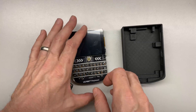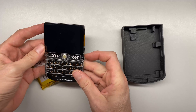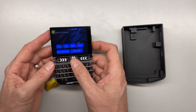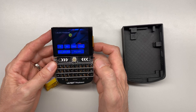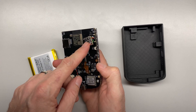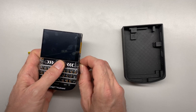Now we plug the battery into the T-Deck, flip the power switch on, and it takes about 15 seconds to boot. The screen works, the trackball works, the touchscreen works, the audio works, and we have a red light on our GPS radio confirming we've got power to GPS.